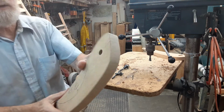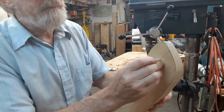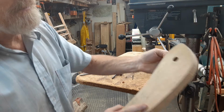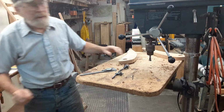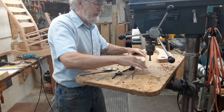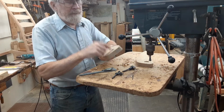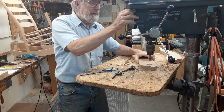So there's that hole through there. That's right where the peg is going to fit. Peg is going to go right in there like that eventually. But that's just by doing that on the drill press right here, like I said before, that just saves, you know, when we drill the 2-inch hole by hand, this just saves that much drilling, 3/4 of an inch of drilling by hand.